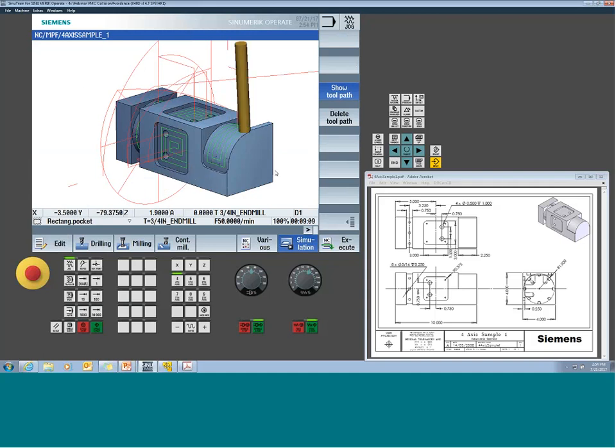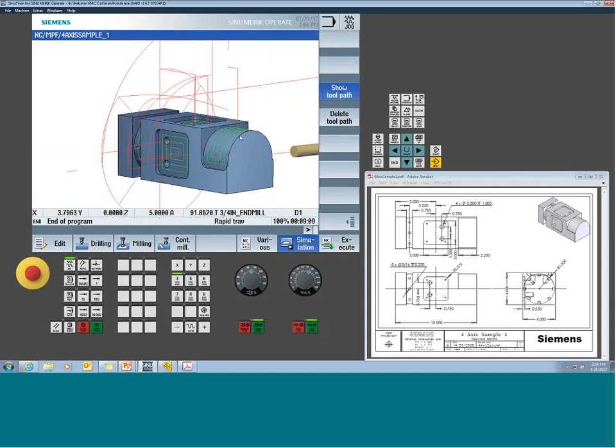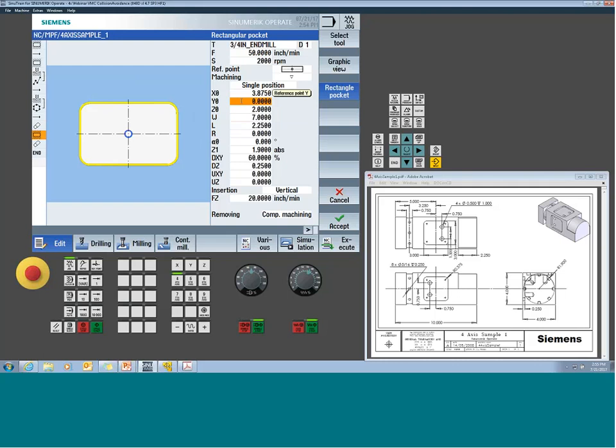Now we're going even further down, you see? So that is that linear distance, the arc length is what we calculated. The other thing that always messes guys up is, again, that Y position, right? They're going to think, oh, well, that's centering me above the Y. It's not. It's establishing the center of the pocket. It's already wrapping. The cycle's already been turned on.